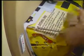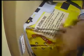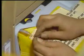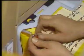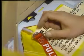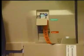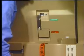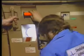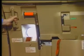Carefully tighten the two stud assemblies with the Allen key until there is no play between the door and packboard assembly. Connect the two pull handles to the stud assemblies with the attach links. Remove the safety pin from the emergency control handle and set the handle to the armed position. Hold the passenger crew door to prevent it moving outboard, and set the door control handle to the open position.